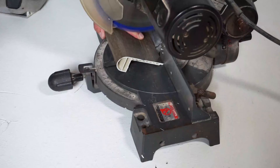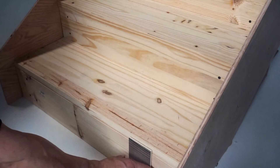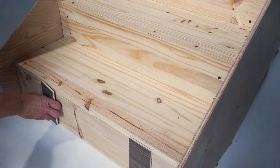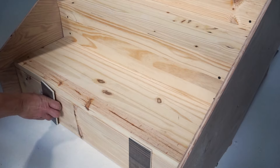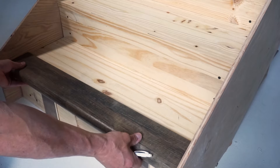To begin, carefully measure and cut the nosing to fit. If using riser material, make sure it is either in place or that you use a piece of the riser material as a spacer. After cutting, dry fit the molding to ensure it is sized correctly and place a pencil line on the back side of the nosing. This line will show you where to stop the flooring product installed on the step. If installing many nosings at the same time, it may be helpful to label each accordingly.